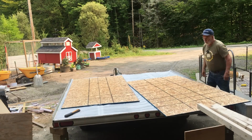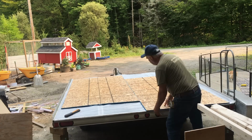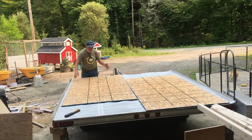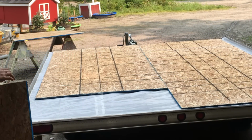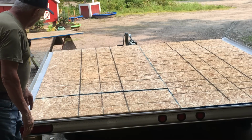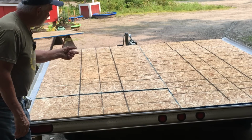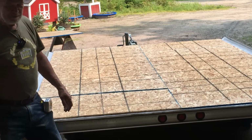And I want to stagger these joints because we're 10 feet long. Then I'll just put 2 small pieces. I won't bore you with this. I'm just going to center everything and get it all situated. Then we'll be right back. And this will be the one that'll fill in this. Okay, so that's the start, that's the bottom. I'll run 2x4s all the way around and secure that. Then I can put insulation inside, and we'll have a 2-inch foam floor, insulated, not heated. Heat is extra.